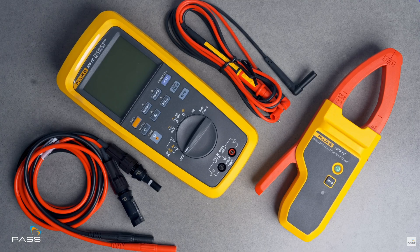Is there anything else we should know about the Fluke 283 digital multimeter and current clamp? The meter comes with the clamp, which is a very good solid clamp. The connectivity is fantastic. The alarms work amazingly. The self-check is unique on this meter. The test leads are the twist ones, rated to both 1500 volt Cat 3 and 1000 volt Cat 4, so you have the ability to rotate between the two. They include MC4 adapters as part of the kit. You can buy just the meter, the meter with the clamp, or the full kit together — there are options you can build on.